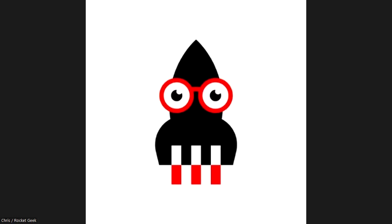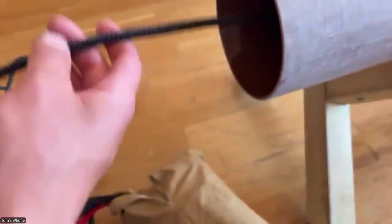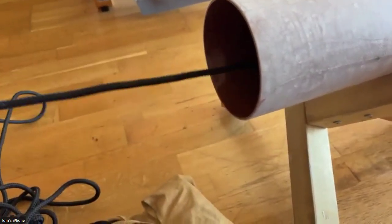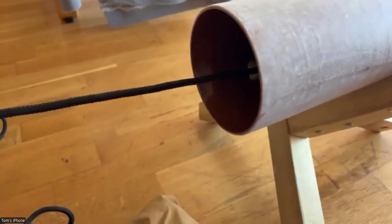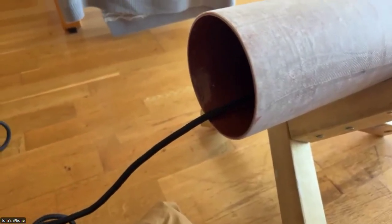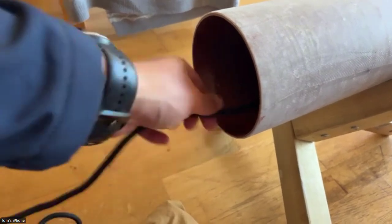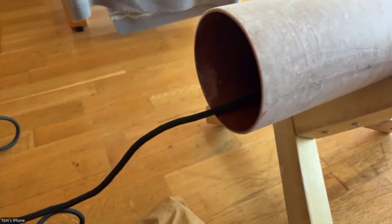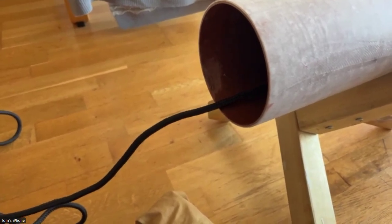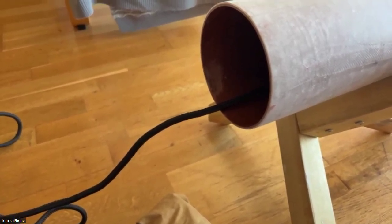Are you doing anything to see where that shock cord is laying against the edge of your tube there? Yes. We will be using a 20 millimeter foam that's currently on order, secured at the point of contact just to stop zippering, which is a problem we've had in previous ejections. Oh, so you have seen that. Yeah, we've had zippering occur previously, so we were trying to be quite cautious, especially with the cord being 8 millimeter. When we previously used 1/2 inch tubular nylon, which has an increased surface area, so we do want to minimize the risk of any damage to the airframe.